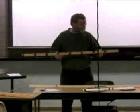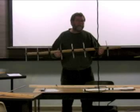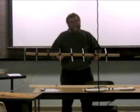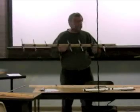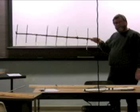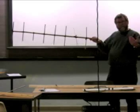This one I threw together last spring in a very short evening in my workshop to track a 433 megahertz tracking transmitter on a rocket that the Esther Cutter Group took out to Las Cruces. And John Chandler saw to it that my way was paid to go out there. And so this gives some directivity in this direction. So if I've got a signal source off to the west here on this kind of an antenna, I can sweep it while I'm either listening to my radio or watching a meter on my radio for signal strength.